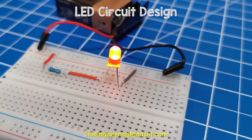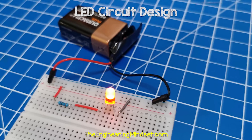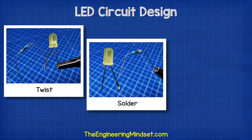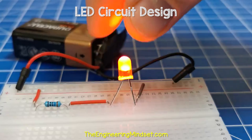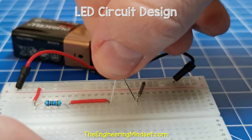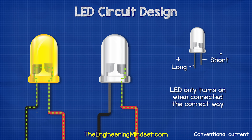I'm using a breadboard for this, which makes it very quick and easy to test electrical circuits. But you can also just twist the wires together, solder them, or use some connectors — it will all work fine for this simple experiment. Notice that if we turn the LED around, it blocks the current so it will not illuminate. It only works in one direction.